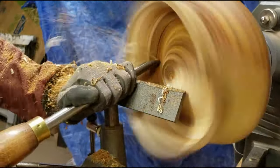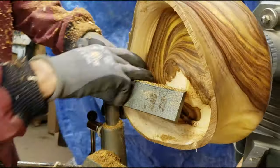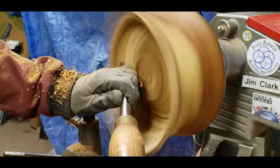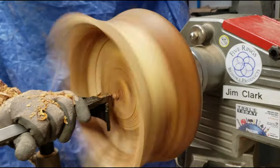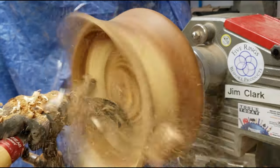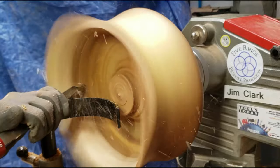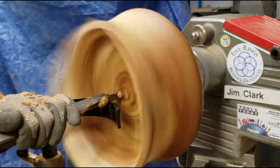If you look carefully, you'll see that my tool is extending pretty far beyond the tool rest at this point — four or five inches maybe. The farther out that gets, the more vibration you get and the more risk of getting a catch where the wood grabs the tool, sometimes violently. So you really want that tool rest as close as possible to the wood being cut. Here I've changed my tool rest and switched to carbide tools, which go straight into the wood right at the center line of the spinning bowl. Since it was getting so deep and I was having trouble with the angles, I switched to that to make things a little bit easier.